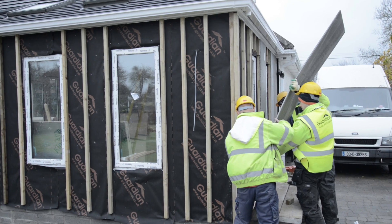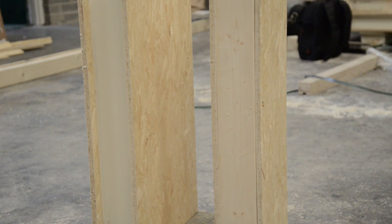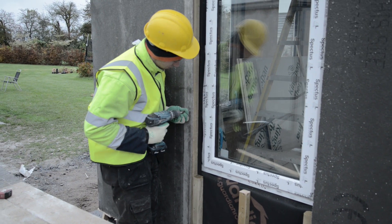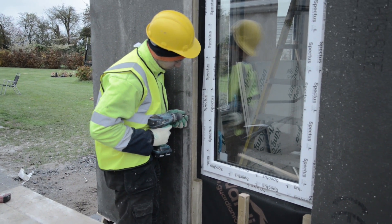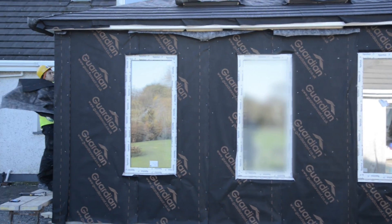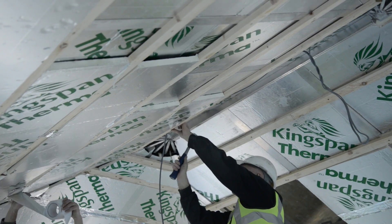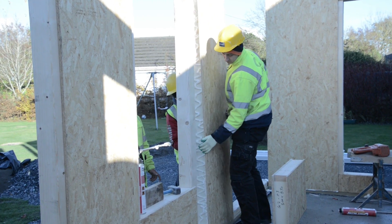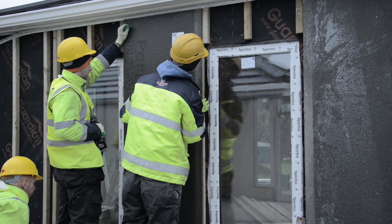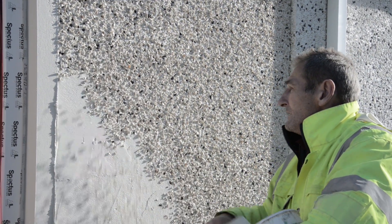Although the tech panel is the nucleus of our system, it's a combination of products which gives a U-value of 0.16 — really, really incredible — making it far more high-performance than the house itself. From the inside out, we have our skim attached onto foil-back plasterboard, which is attached onto battens, which is attached onto the tech panel. On the outside, we have our breather membrane, battens, a cement fibre board designed to take our high-performance render, which is made sympathetically with regard to the existing house wall finish.